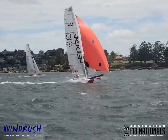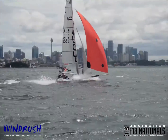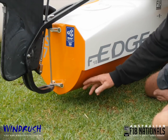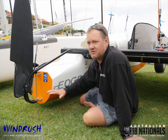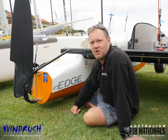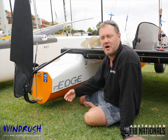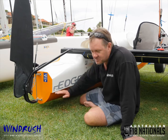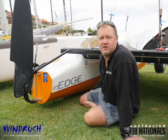So that means you can drive it really hard downwind? You can really drive it hard because it allows the bow to sit up more. And there's a lot of volume under the bow as well. But this chine makes the lift, and this allows the boat to sink and utilise that lift really well. It also gives a really clean water flow on the outside of the hull when you're going upwind — instead of the waves wrapping up around the hull, they tend to come up, hit this, and square off, which also possibly reduces a bit of wetted surface drag.